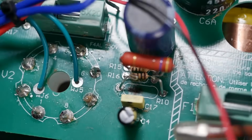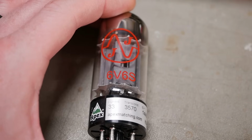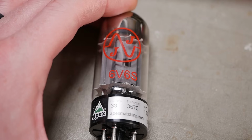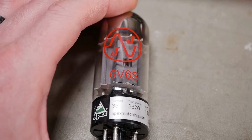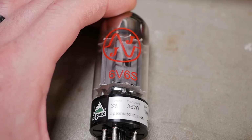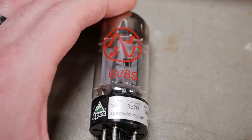So this has had a shorted valve. So this JJ's would not be stock. This would be a replacement. Previous valve shorted and taken out. Probably the cathode capacitor and resistor, and they've replaced them at some point, and then just sold this as customer return. So it's actually been repaired. So this would have been a warranty return. I guess they didn't go that deep into detail.